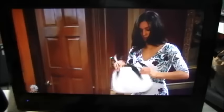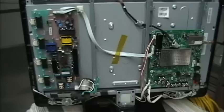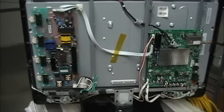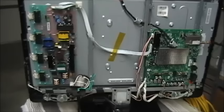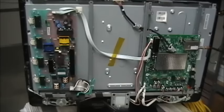So what's the point of all this? Let's look at the back. We used the sun. Anyone facing the white screen on this model or some other model might want to try the same thing. Put it out in the sun, bring it back in, see if it works. We're indoors now, it's probably 75 degrees in here — a big difference from 104. So the next step would be to let it cool back to room temperature. An hour or so from now, this TV will be back to white screen. So the next thing we can do is remove these boards one at a time.